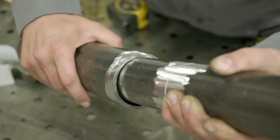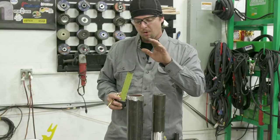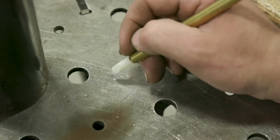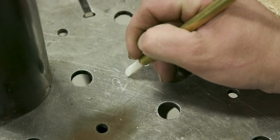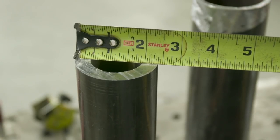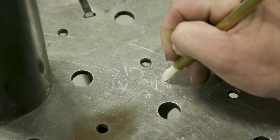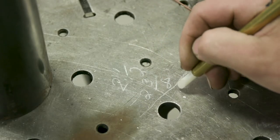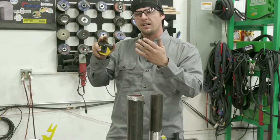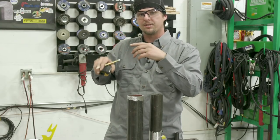You see how loose this pipe is — we want to split that gap evenly all around four sides. We're going to measure the ID of this pipe: it's two and a half. I always write measurements down. Then we're going to measure this pipe — it's two and three-eighths. So we take two and a half minus two and three-eighths, that's an eighth inch. Divide an eighth inch by two because we've got two spaces on the gap, so it's going to be a sixteenth.